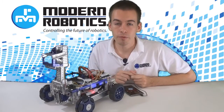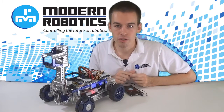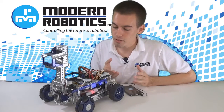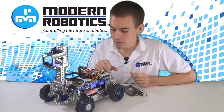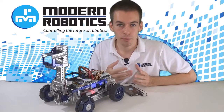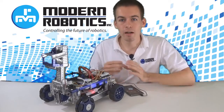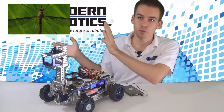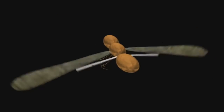It's important that before you calibrate your gyro, you let it warm up. This can be just 30 seconds or so. The gyro just needs to be on. Once you turn on your power distribution module, there's an LED on your core device interface, and when your gyroscope is blinking, it's warming up. Instead of explaining why this needs to happen, there's an awesome video that shows how electronic gyroscopes work — I recommend checking it out after finishing this video.